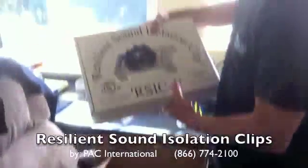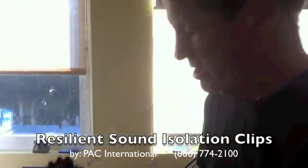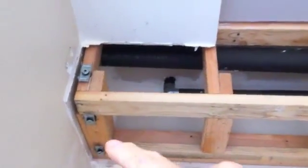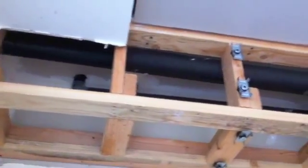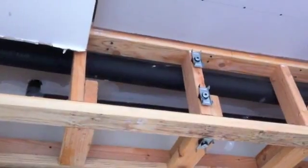Resilient sound isolation — this is my favorite for isolating vibration from upstairs. Resilient clips. Here we see the resilient clips that are hung up on the new wood soffit, and we'll put hat channel over those clips and then hang the drywall to the channel, thereby insulating it. Hat channel hanging on resilient clips.